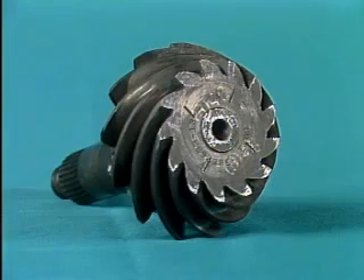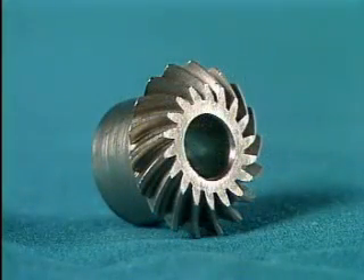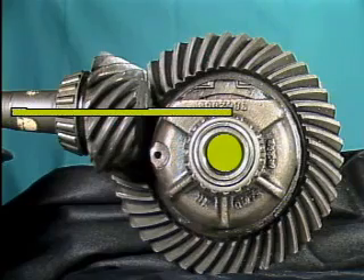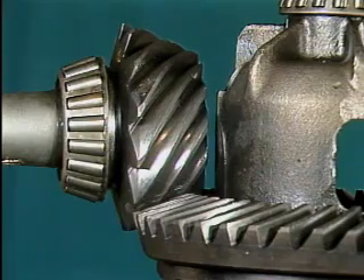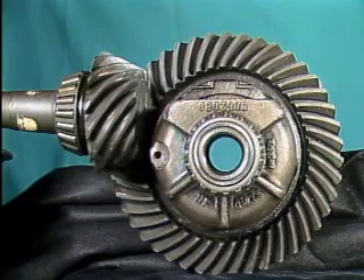The last type of gear we'll look at in this part of the program is called a hypoid gear. A hypoid gear resembles the spiral bevel gear in some respects — hypoid gears are shaped like spiral bevel gears and are used on cross-axis shafts. But unlike bevel gear sets, the shafts of hypoid gears do not line up with each other; they're offset. This offset allows hypoid pinions to have as few as five teeth in a high-ratio gear set, while bevel gears typically don't have fewer than ten teeth on a pinion. This means larger ratios can be obtained with a hypoid gear set than with a bevel gear set of the same dimensions.